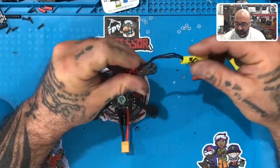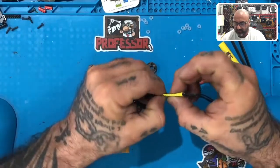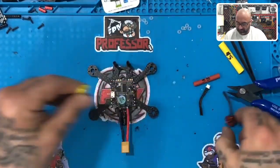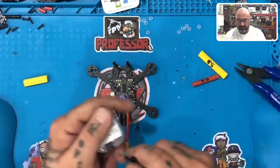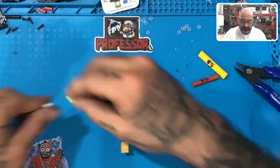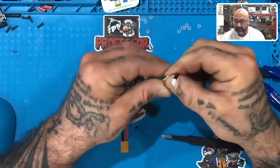We're going to start with the back motors — those are going to be 30mm. Basically what you do is you line it up to the bell, and that's 30mm. If you follow this pattern and line it up, all the wires are always going to be the same length. We like symmetrical things here. So there's one back motor — we'll put that one over here. Let's do the next back motors.